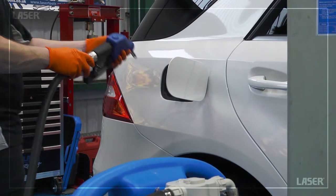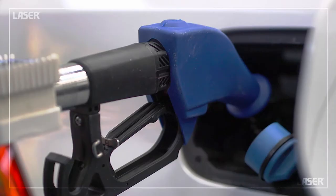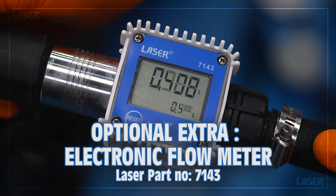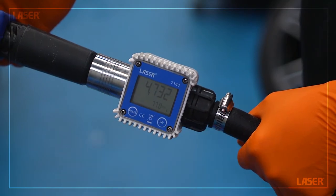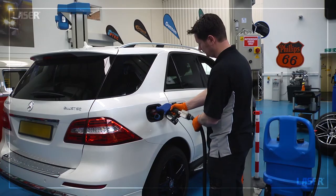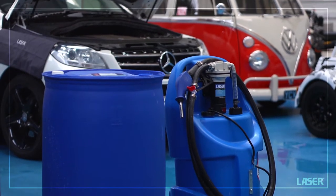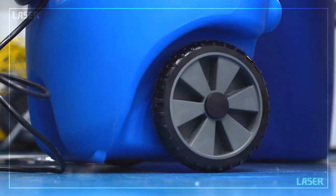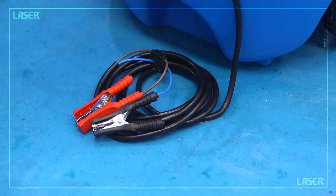The professional nozzle has an auto shut off function and the pump delivers up to 17 litres per minute. This optional electronic flow meter gives an accurate measurement of fluid used for correct customer invoicing. The unit features large diameter wheels which are great for uneven ground, so that AdBlue filling can take place out of the workshop.